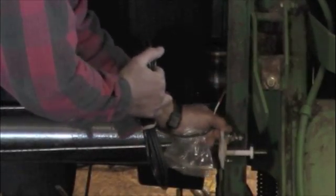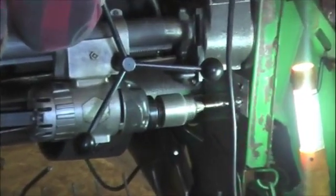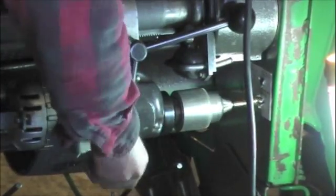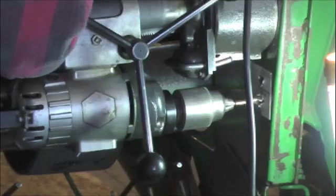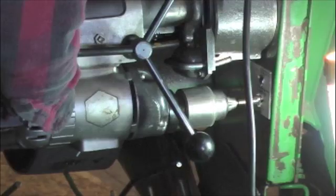This is what the sensor looks like with the extension kit. The first thing that we do is drill the half-inch holes. Here we're using an electromagnetic drill press to drill the holes. These holes go from the inside of the baler through the tube frame out the other side.